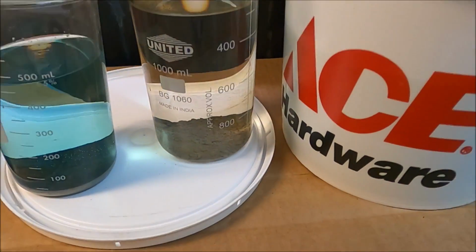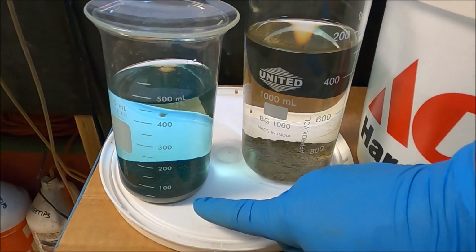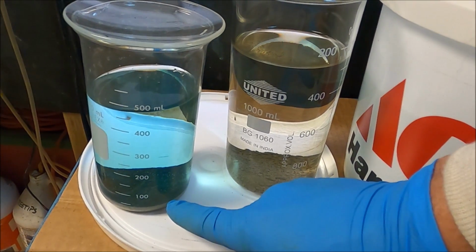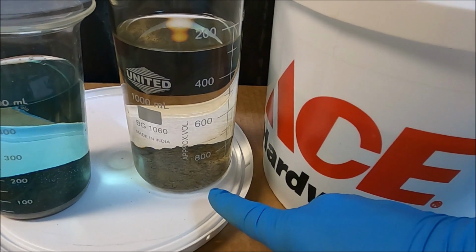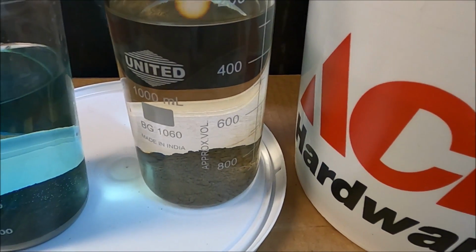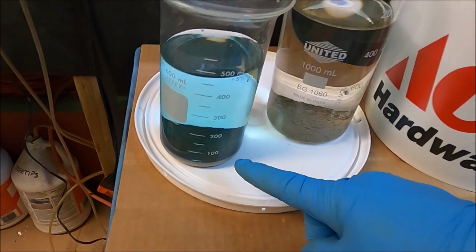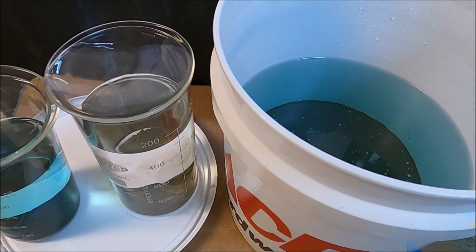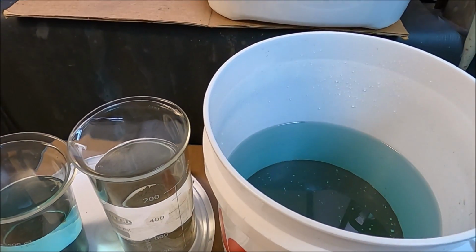And then down here, I've got the 2 candle holders that I refined with sulfuric acid. I've got all the waste in this beaker here. What I'm going to do is redissolve everything with sulfuric acid and try to re-precipitate it. This is the pure silver that I got out from the very first experimental try that I did. This was not on video. This was the silver that I got out of the first refining I did off camera. And then here's all our waste. It's all settled to the bottom. And I'll get that out of this bucket and put it in with this and redissolve it in sulfuric acid. But I'm overwhelmed here with all this stuff I got to do. I've got a whole bunch of new projects that I want to try, including the electrolytic gold refining cell. And just an update on what I got going on here.